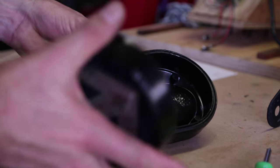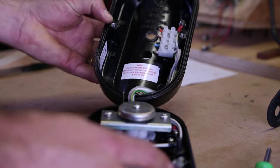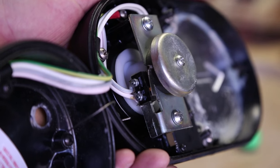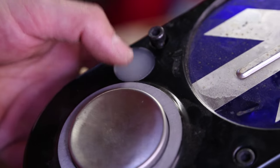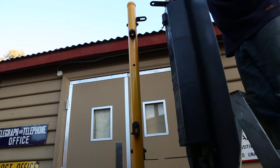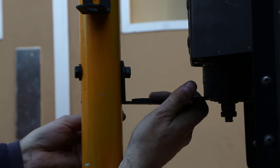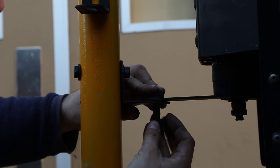I finally got on to actually working on the other assemblies, which included this switch — an actual working switch that I got from a traffic supply company who was getting rid of them. I wanted to get the LED working as well as the switch, but I found that the LED was actually rectified for AC use, so I pretty much scrapped the existing works except for the switch and the wiring to the switch. I kept those elements.